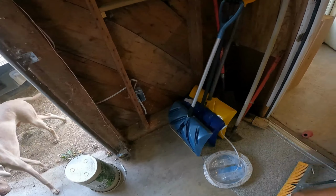It's the same. So anyway, we got an adapter to go from a range to a welder, because I already have a welder outlet right here for my welder. And I wanted to utilize that circuit because it's already here. The wire's already here. It's already in the box. It's the right amp rating. So I wanted to utilize that. So now we can. So anyway, those two items together were $75 on Amazon, brand spanking new, shipped to my door. So pretty inexpensive. I'm pretty pleased with that, actually.